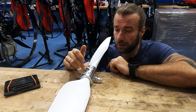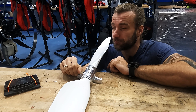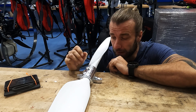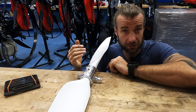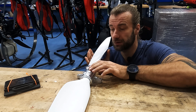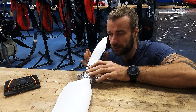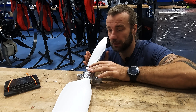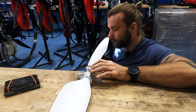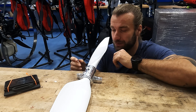It fits so nicely together. I only had to add one little spacer just to remove the last little bit of play. I will adjust the drawings accordingly so we don't need to use that later. There is no play — very direct connection between the two blades. I love this. Even these blades are so beautiful. I think I'm going to keep them in white — white is aviation color.